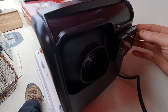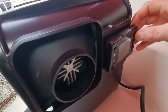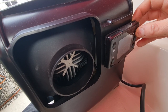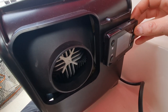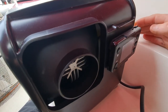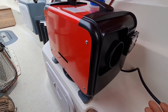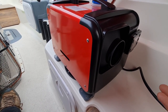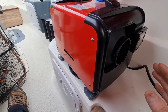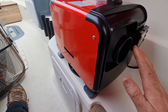Let me go up now to the maximum setting. Going up — two point, three, four point something, five — there it goes. Now the fuel pump has increased; the clicking you can hear has gone faster, so it's now pumping more fuel to the burner. The fan is increasing and the heat is certainly increasing.